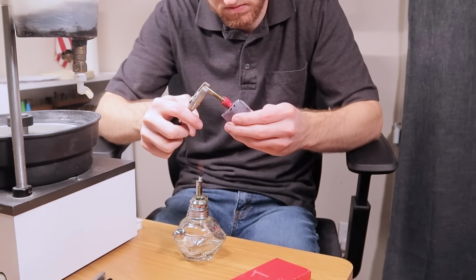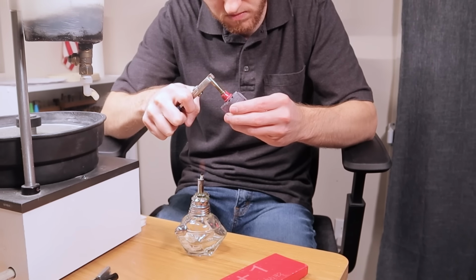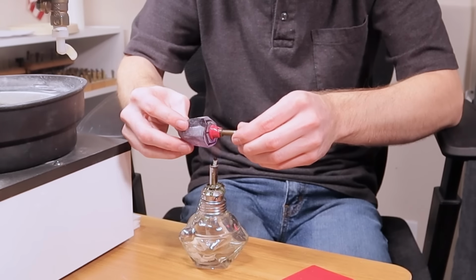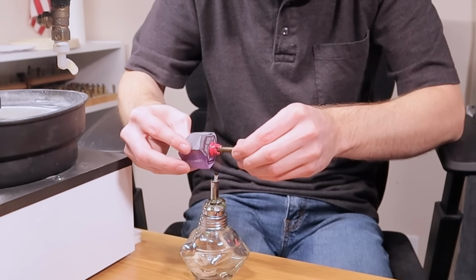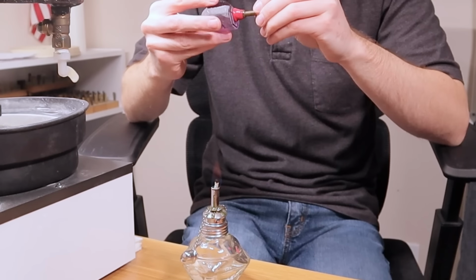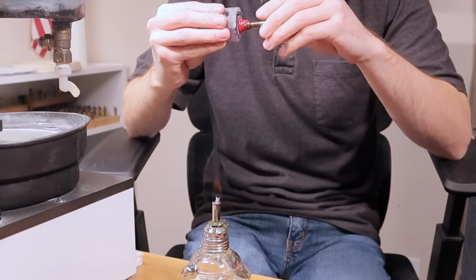The wax also gets in the way of alignment marks I put on the dop, making it not as easy to align perfectly with where I put the center point. Attaching the dop with wax took about 15 minutes, where gluing takes about 1 to 2 minutes. On the flip side, gluing takes time to set, whereas wax dopping is ready to work with right afterward.